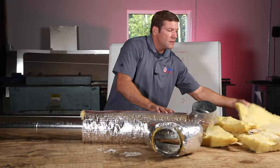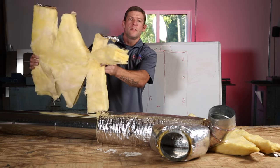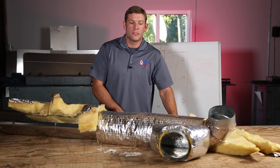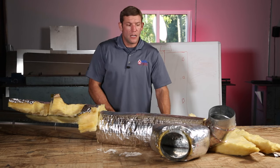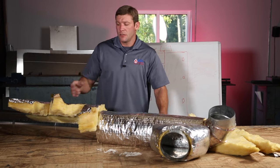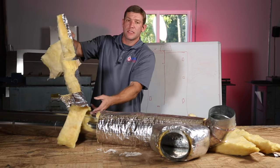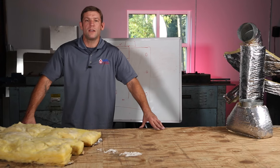You could also make up a bunch of elbow patterns for all your six-inch turns. If you have a hard pipe duct system with a ton of elbows and no way to dry-fit or figure out your lengths, just go ahead and run it — have elbows with these little tag ends that can be trimmed down to whatever strip-out size you need. If you enjoyed this video, please like and subscribe to my channel. Leave any comments in the comment section and I'll do my best to respond. I'm Andrew with AGL Mechanical Tips, and remember: your quality is your reputation.